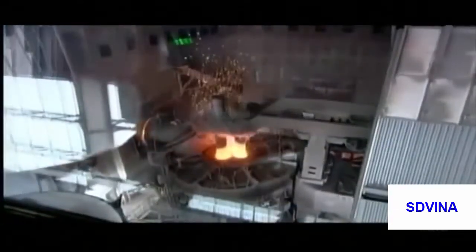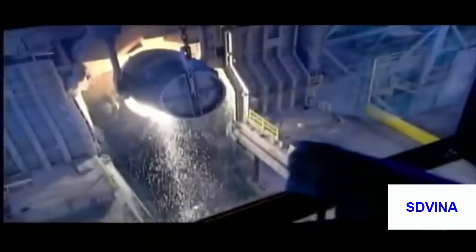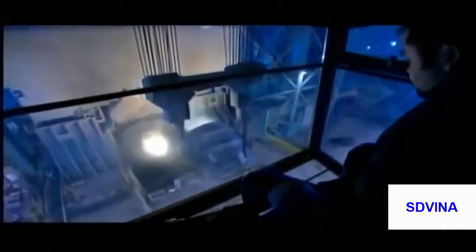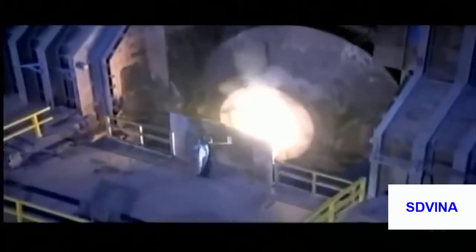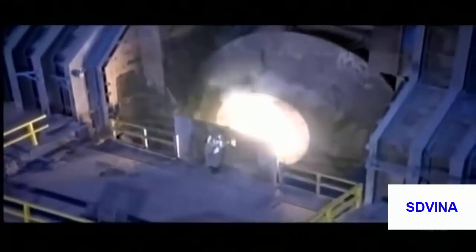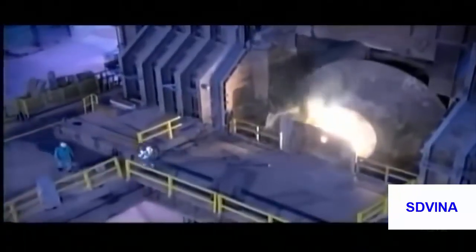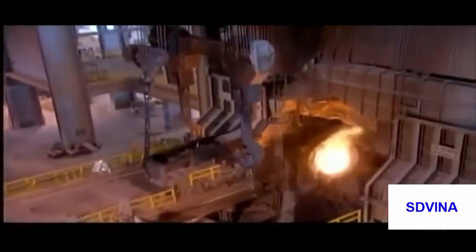After several hours, the molten mix goes into a refining furnace. Pipes blast in argon gas and oxygen, converting some impurities to gas and causing others to float to the surface for easy removal. A technician regularly checks the temperature and takes samples to make sure the chemistry is right.